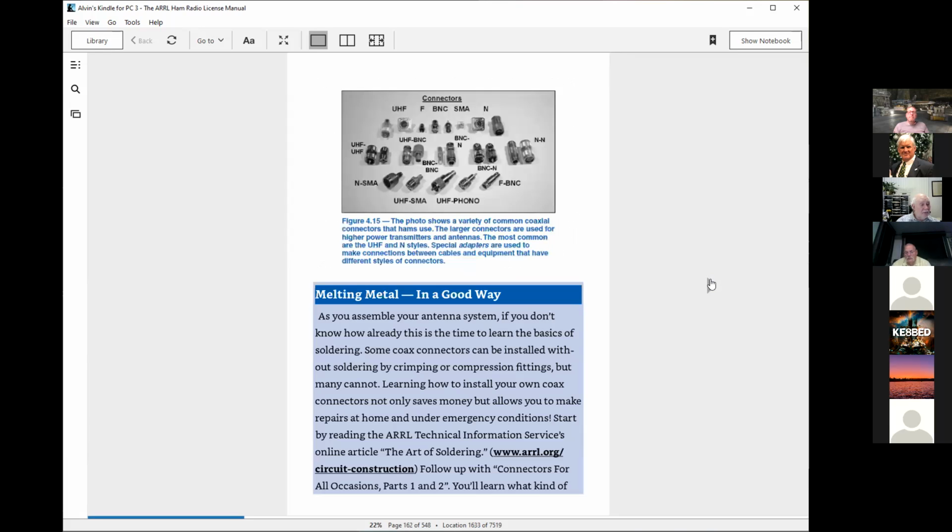Okay. Oh, one thing, if you're going to get an auxiliary antenna for your handy-talkie, make sure that you get one that will match your radio. So SMA is the current favorite, and there's a male and a female. I know my Yaesu uses a male, and the Baofeng uses a female.